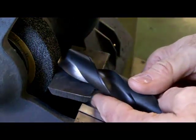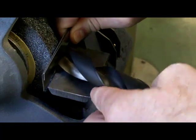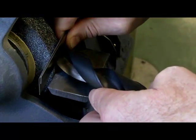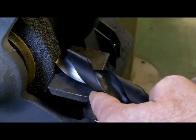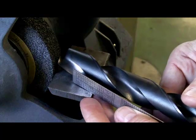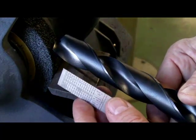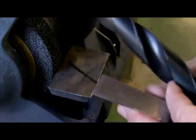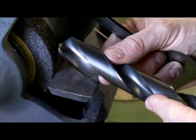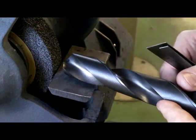A couple of things I need to be paying attention to: one, I want to set the cutting lip onto the face of the grinding wheel and hold it in the horizontal position. I'm taking a rule and setting it on the cutting lip and holding it parallel to the floor — this is important. Second, I want to hold the shank or body of the drill parallel to the floor, and then I'm going to take the tip of the drill and push it up on the grinding wheel a little bit — still holding the cutting lip parallel to the floor — then back down to horizontal. If I go too high, the heel of the drill gets too large an angle and it makes the cutting lip weak. If I go past horizontal with the shank, the cutting lip becomes lower than the heel and it ends up rubbing, so it won't cut.